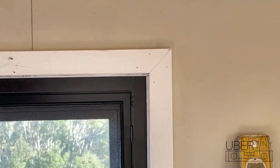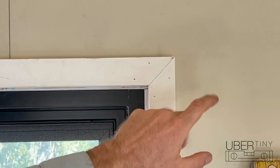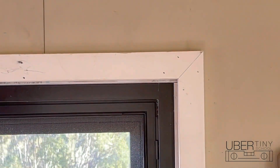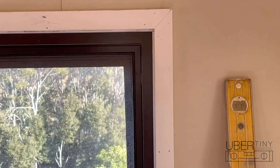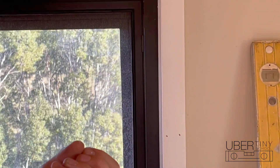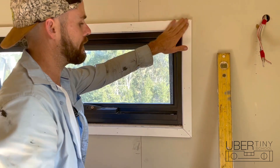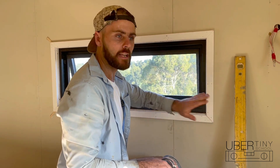Because I put glue in that crack, all the sanding dust falls in and fills it — it looks really good and is dead smooth side to side. It's really important to sand the miters flush because even if it doesn't look too noticeable now, once you paint it any height difference between the two surfaces really sticks out. So definitely throw your sander over those two flat surfaces and give it a hit to make sure it's absolutely perfect and ready for paint.